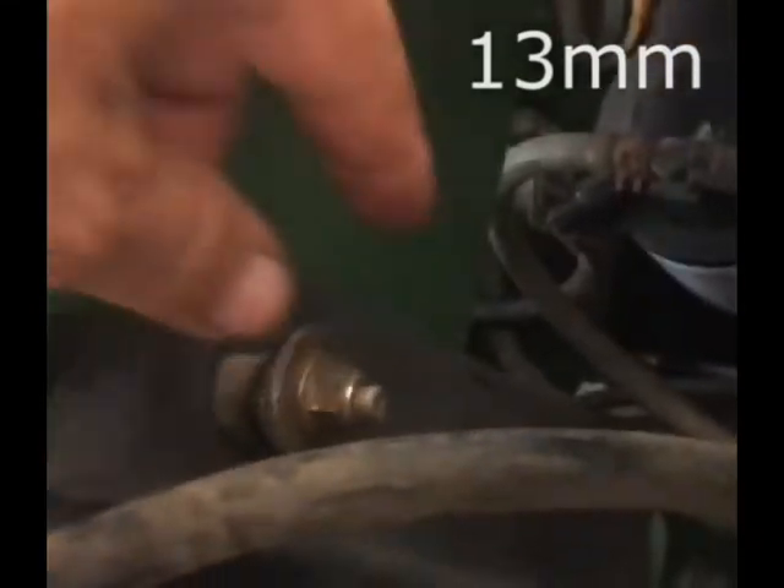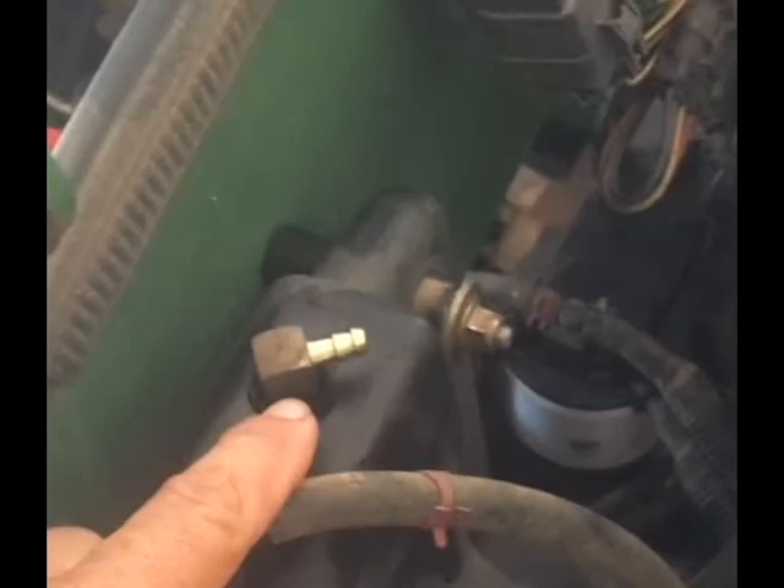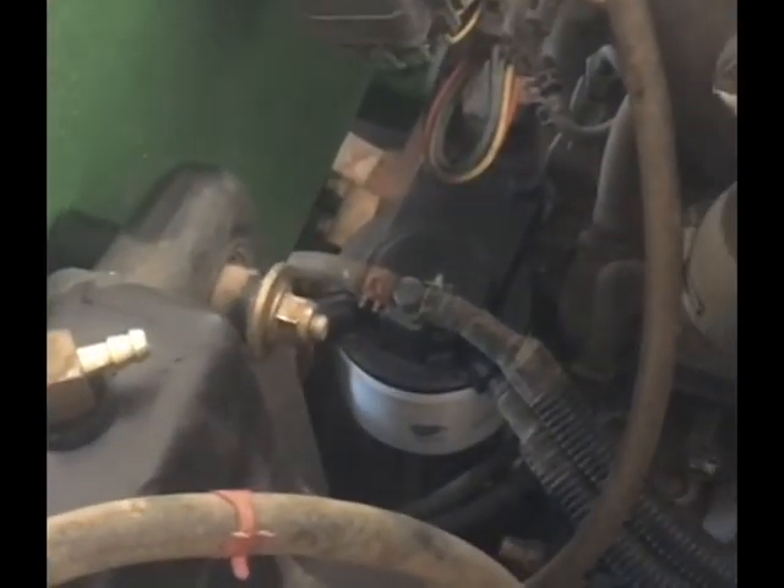If you're going to remove the fuel tank, there are two bolts. One bolt is right here in the back, next to the engine, and the other bolt is going to be up underneath here. Just the two. The supply tube line is going to be this item here — you're going to pull it straight up, and at the bottom of that is where you're going to find the inlet screen filter. It's the one that's closest to the engine.